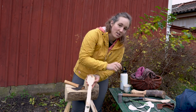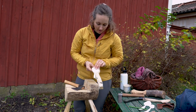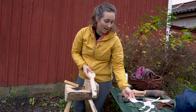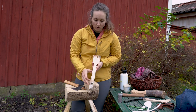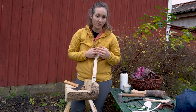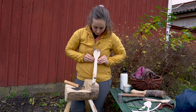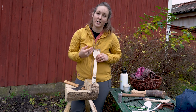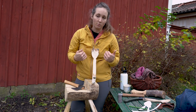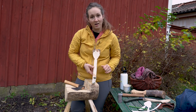Don't worry about that. You don't have to get that close. I'm going to potentially redraw this later. Another carver's advice that I also really respect is that when you use something like a Sharpie, it makes a fatter line around your template. So you axe to the edge of the Sharpie, and then when you're ready to go carve, you will take the template again and trace it in pencil, which will bring it much closer to the size of the shape. You still have room to carve and you're good to go.